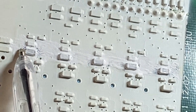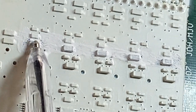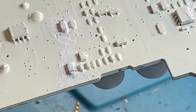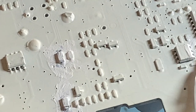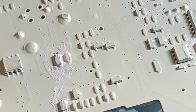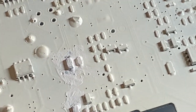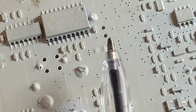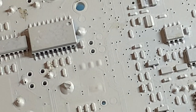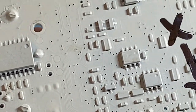If they don't, and there's some other value, because it's part of the filtering system here, change all the ones here to the same 18 nanofarad, and the ones down below there, change that and that and that to 18 nanofarad. I think someone's loaded the wrong reel into the pick and place machine, and it's just gone bang, bang, bang. And I can't remember what they were. It might be 1.8 or something, but if it's wrong, it'll probably have low VCO audio. The swing component, I think, happens here, for memory. This just mixes.